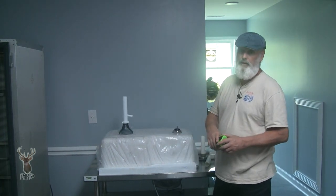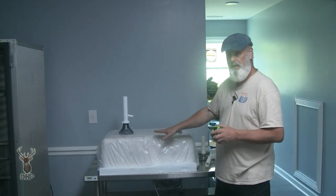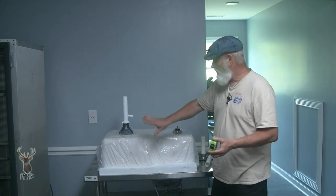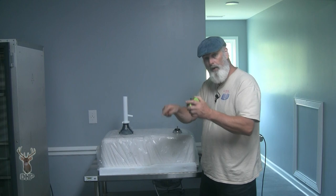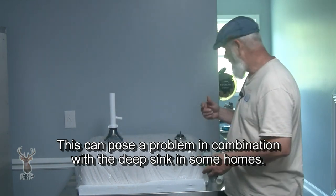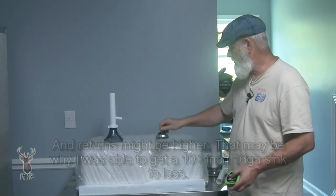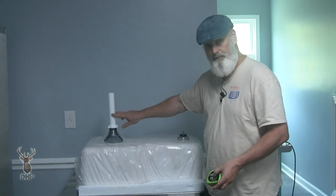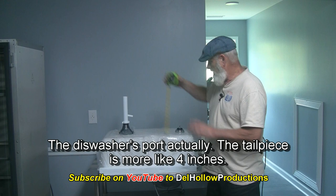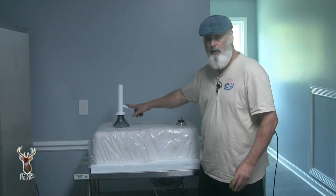That's where a deep tub can be a little bit of an issue: if you're going to have a soap dispenser, you might want to go a bit more shallow. This sink is a heavier gauge of stainless, sound dampened, and a really nice drawn pressed sink — not folded and welded with tight corners I don't like. What came with the sink is commonly called the strainer, but in plumbing terms that basket is the strainer and this other piece is the tail piece. As you can see, the tail piece sits about six inches off the bottom of the tub.